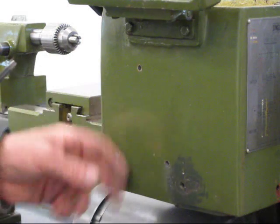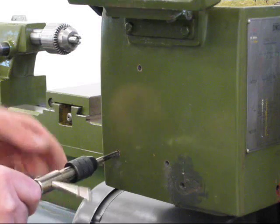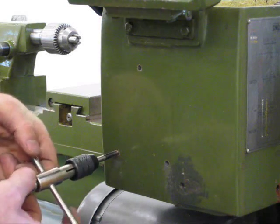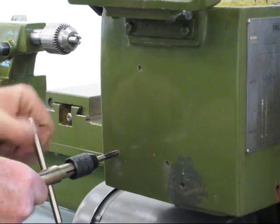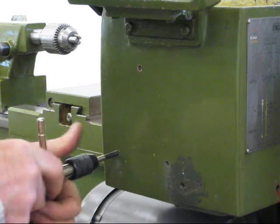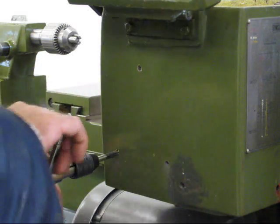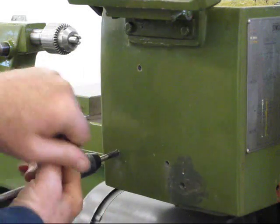Because of the size, the quarter-20 tap is what I'm going to be using here. It's going into cast iron, so the tapping is quite nice and I don't need any cutting fluid. I did tap the other holes in the aluminum without cutting fluid as well — the cutting fluid I probably would have used would have been WD-40, because that's about all it's good for. This cuts quite nicely and I'll just tap it like so. Not tapped in there quite nicely, actually.